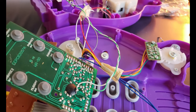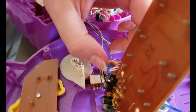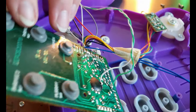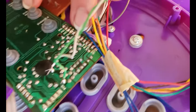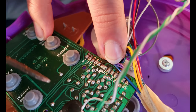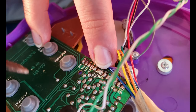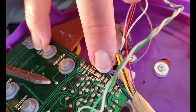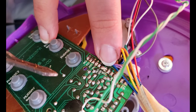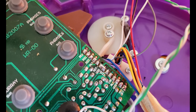But then it gets wrapped up in a bunch of different wires. So as you can see, this is a wired mess right here. But I know that I'm looking for blue wires. So what I can do is look really closely right here, and I'm going to use my solder light. And you can see that there are these two blue wires. And they are labeled speaker. So that's a good indication as well. But realistically, I'm looking for these two blue wires right there. And that's going to tell me that I'm dealing with my speaker right there.